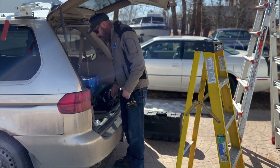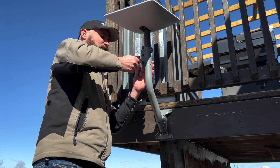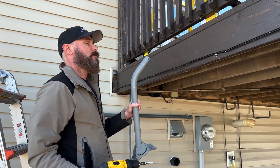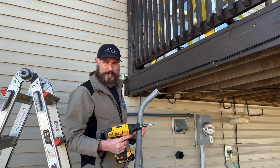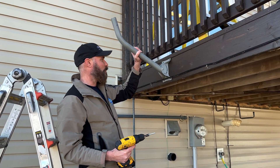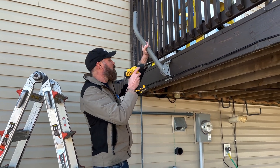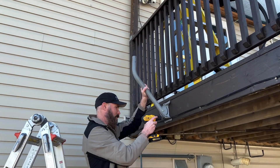We're moving the dish over to this side of the deck and going straight up — we want to be just in front of that eave. We have a longer 10-foot pole that we're putting in, and we're going to use a tripod rather than just a single unit. This is really important to install correctly right here, because I have to make sure this is lined straight; otherwise that pole is not going to be straight.